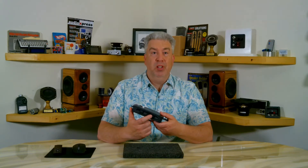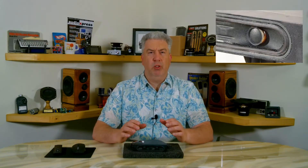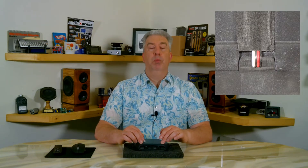This is not a subwoofer, however. The two voice coils are on two separate cylinders, separated by several inches. Why would you want to design a speaker this way? It could possibly be to create a very small two-channel stereo speaker within one enclosure to keep size and costs down, possibly in a small LCD TV. The treble and mid-range frequencies could vibrate individually, while the lower frequencies with their larger cone movements would be handled by both concurrently. Another more plausible reason is just to give manufacturers some wiring options, as the two 6-ohm voice coils would present either a 3 or 12-ohm load, depending on whether it's hooked up in parallel or in series.